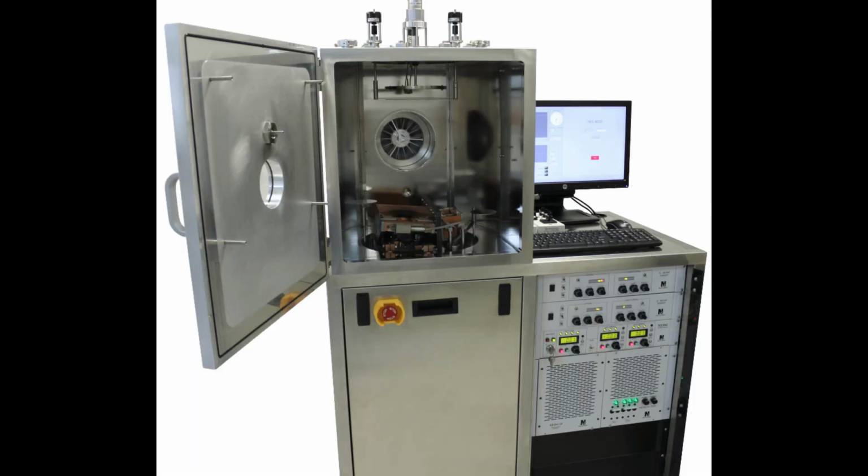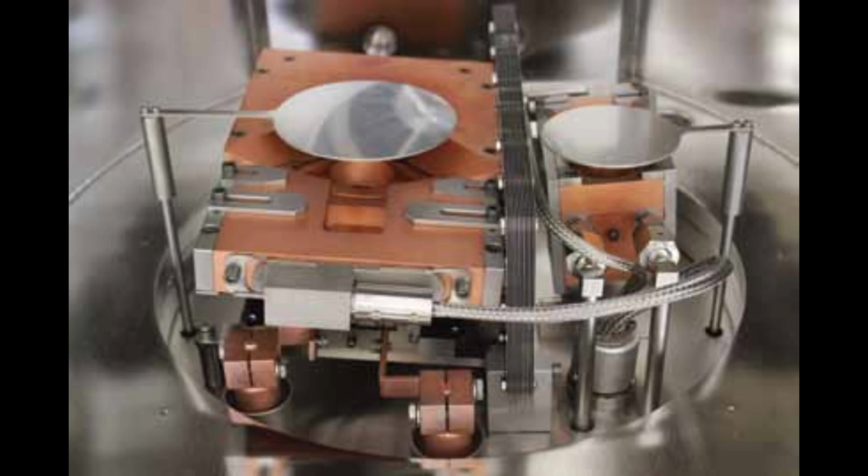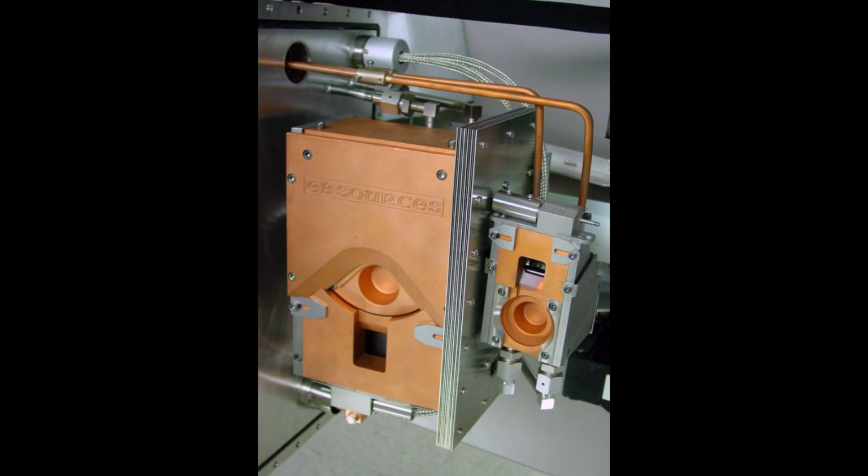They are also designed for multi-wafer easy load-unload planetary rotation substrate holders. Besides collecting many capabilities in one chamber, this configuration is also more suitable and can be customized for production requirements. Dual-gun evaporating systems are developed for co-evaporation of two materials for composite film deposition. Single-pocket gun and multi-pocket gun shutters and turrets are computer-controlled with user-written recipes.